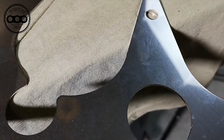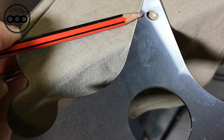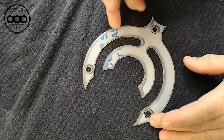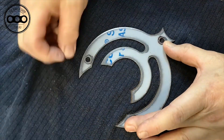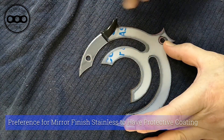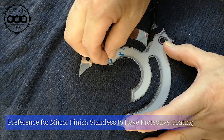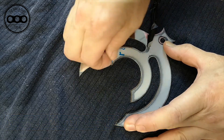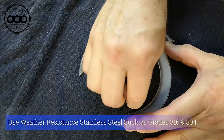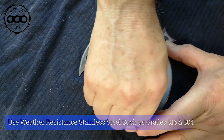If we were to zoom in on these holes here, you could see a tiny little bit left behind from the lead-in and out, and it's consistent all over, but nothing to cause concern — you don't need to clean up. Just use your fingernail only. Don't use any metal objects, because you could risk very easily scratching this material surface. Peel it back, and what we're left with is this little residue that's left behind that we have to remove. Especially with a large item, it can be quite tricky to remove.